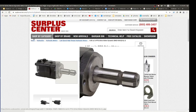Like, say I have a bunch of agricultural implements and I have a tractor, and I want to be able to connect them safely. I might have a cube with this motor inside of it that allows me to safely interface to the tractor and to the implement. The power cube is already self-contained. It's got the two hydraulic outputs, two or three, and the transmission is your hoses. So they're pretty safe. Short of blowing up in your face or something, they're relatively safe.